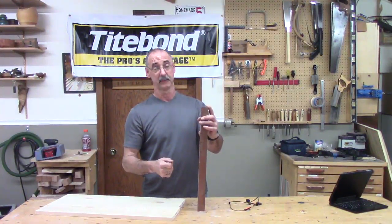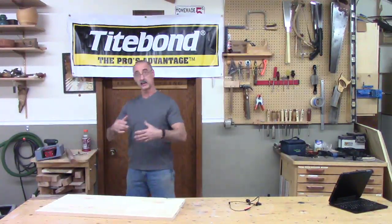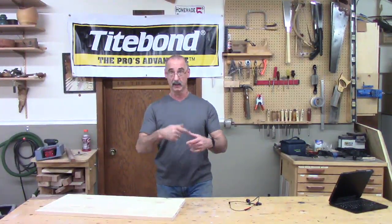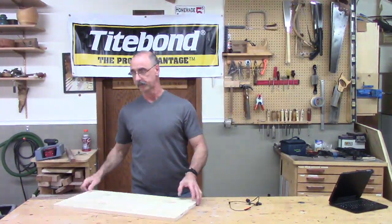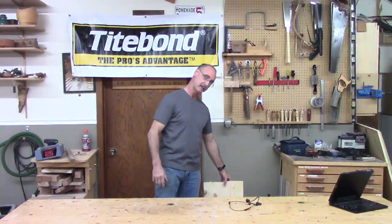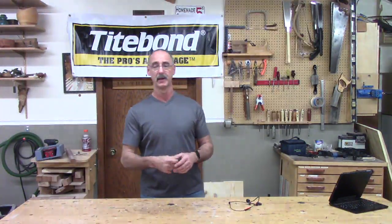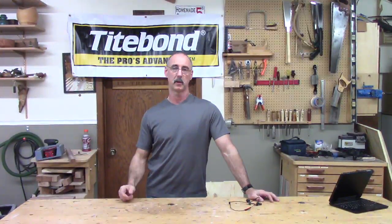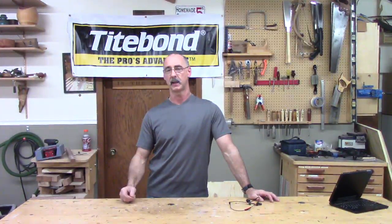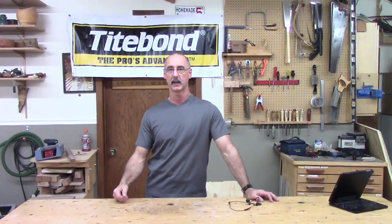If it's a solid wood, then you need to use tabletop fasteners, and that'll allow a solid wood top to expand and contract independently of the base unit. So on WWGOA, we've got lots and lots of information about tabletop fasteners. In 45 minutes, when I start posting answers to these questions, I'll source those videos and articles that we have about tabletop fasteners. But man-made material to a leg and rail assembly, pocket holes are a great choice for that.